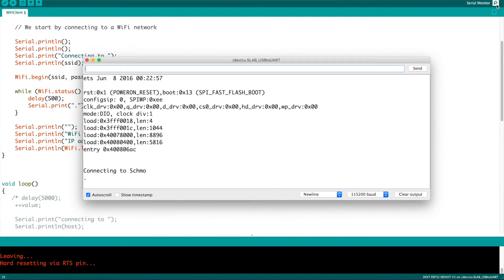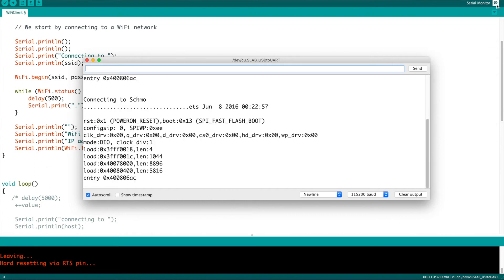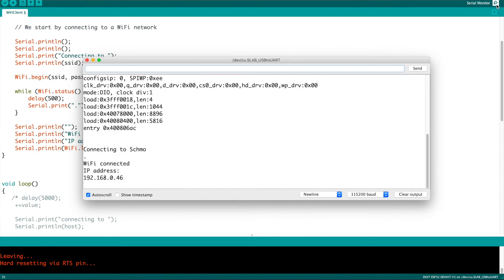But as you can see, the not-connected script that causes it to keep looking will sometimes just hang and go on forever, never making a Wi-Fi connection. What we're going to do is add a counter so that after a certain number of attempts, instead of just infinitely going on, it's going to reset the ESP32 and then run that script again. That's much more effective — many times it catches on the second or third try, but before long it's up and running and always connected.